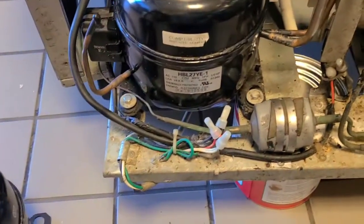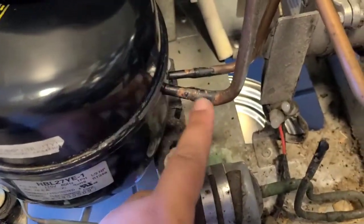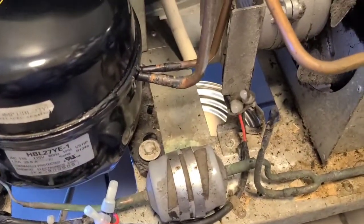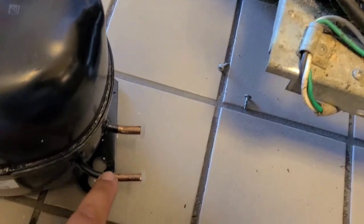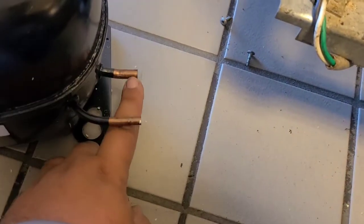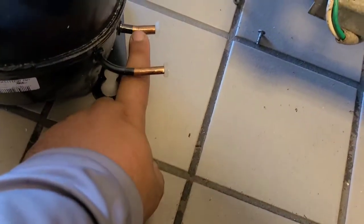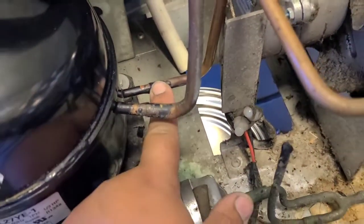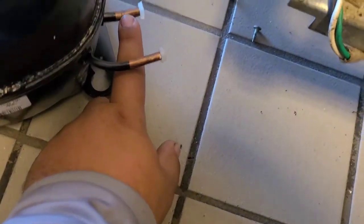Something to be aware of — I just noticed my suction line and discharge lines and how they're oriented. On the new one, the suction is actually on the bottom and discharge on top. You can see it's bigger. I Googled the model number — it shows suction and discharge. So it's backwards: discharge on bottom, suction on top on the old one; suction on bottom, discharge on top on the new one, plus the process port too.